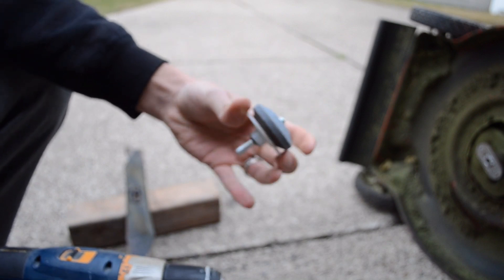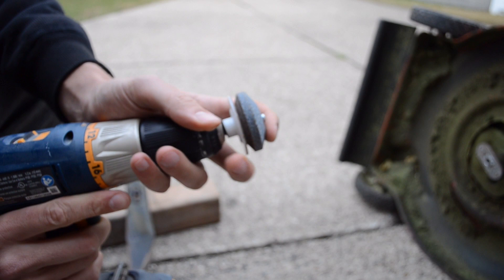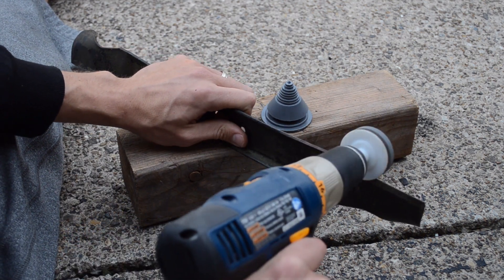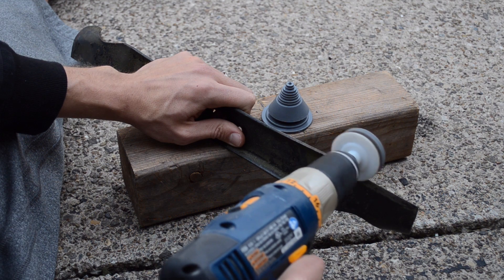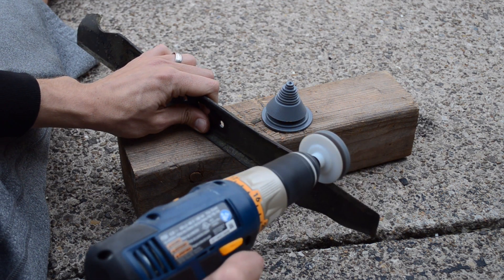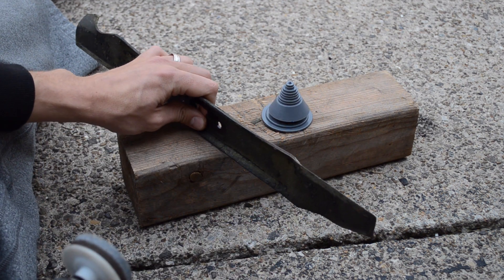This is how I'm going to sharpen that — it's this piece right here. Just put it in just like you would any kind of drill bit. I'm putting the plastic edge on the flat side of the blade, and on the other side of the blade is where it's actually sharpening with the grindstone. I'm going to flip it around and get the other side too. I did do more than this, but I didn't want to show you all the sharpening that I did.